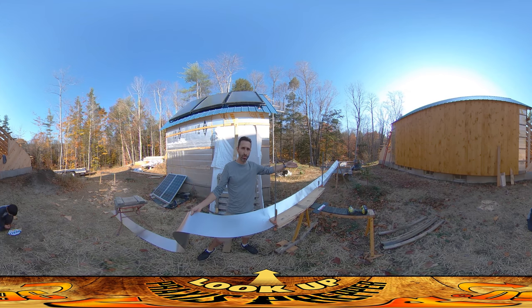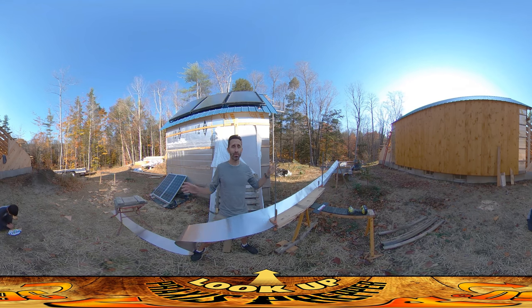So that's the basic procedure — loosen the clamps, slide it through, and repeat. I bought a 50-foot section of this flashing and thought it wouldn't be quite enough since each side is a little more than 25 feet, but the roll is actually slightly bigger than 50 feet, so I'm able to get both sides out of it without adding any. So it's just flashing and wall boards, repeat the whole process again, and we're running out of areas of the house that aren't done. That's a nice feeling. Thanks for watching.